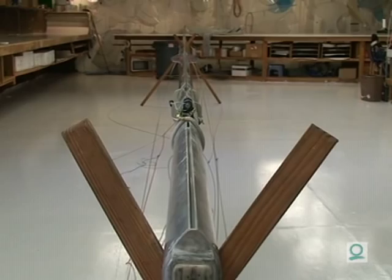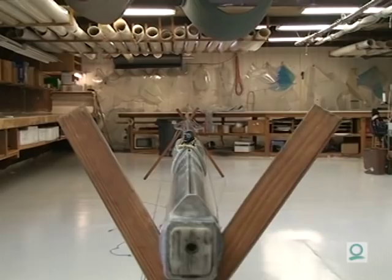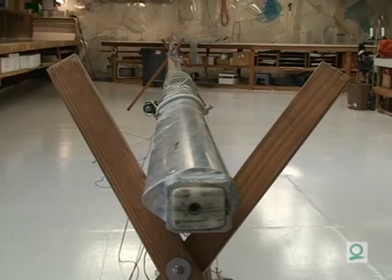The next thing we like to do is make sure that the mast is perfectly straight. If you can see through your sail track from the top to the bottom of the mast, then your mast is ready to go sailing. We'll also check that the mast has no kinks or bends fore and aft.